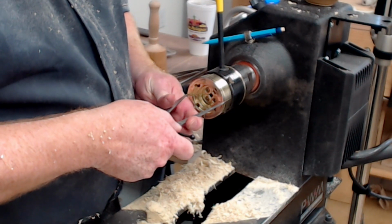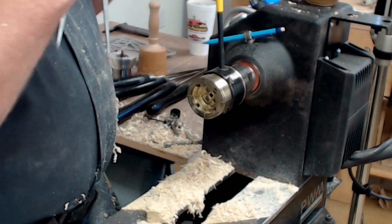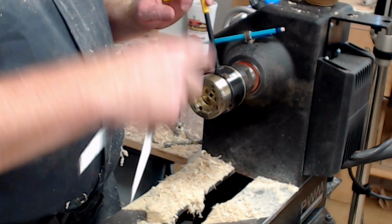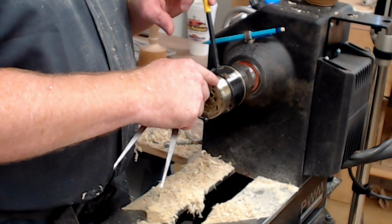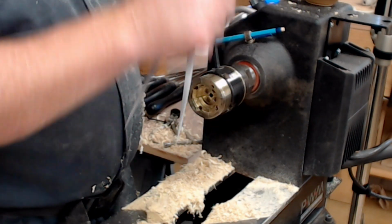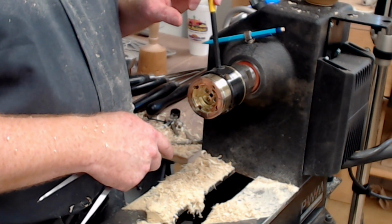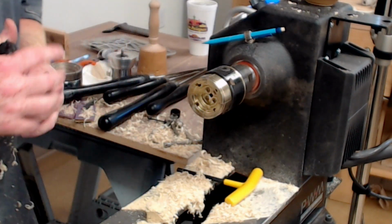You want to measure that gap right there, and you want to cut straight in at that point. And then put just a very thin dovetail, usually with a skew chisel on the outside to cut that in, and you're going to be holding the entire grip of this chuck, and not 4 points. You're not holding on 8 points. You're holding on 4, because you're only holding at the center point of each of your jaw sets. And there, it's even more of a danger than not.